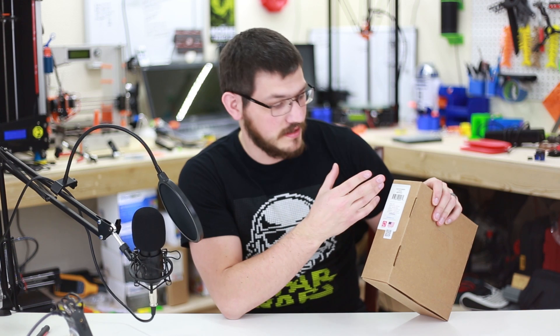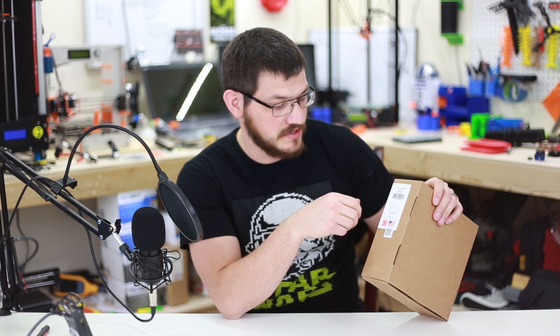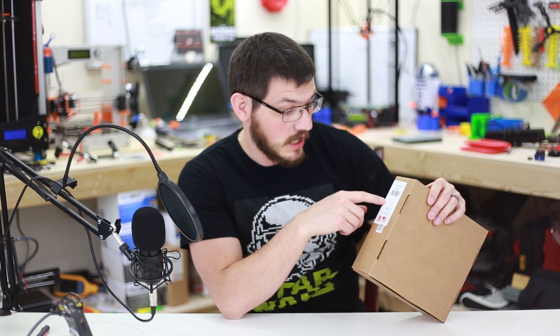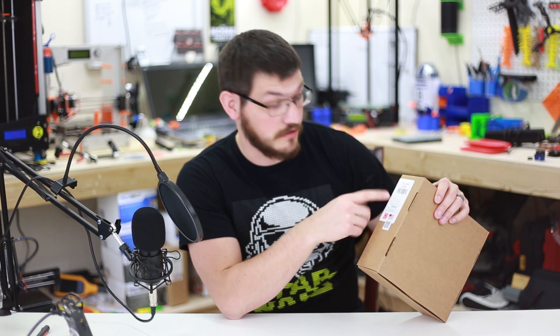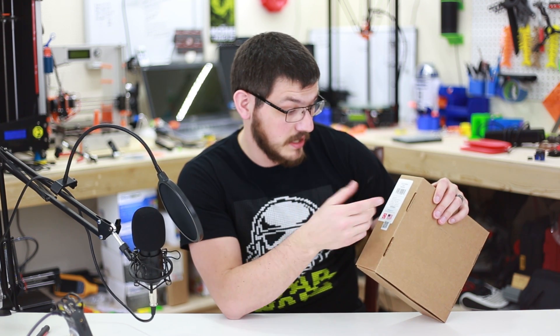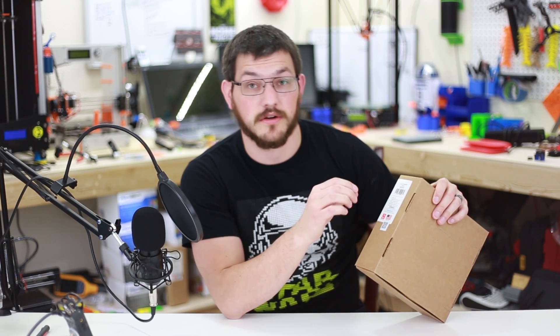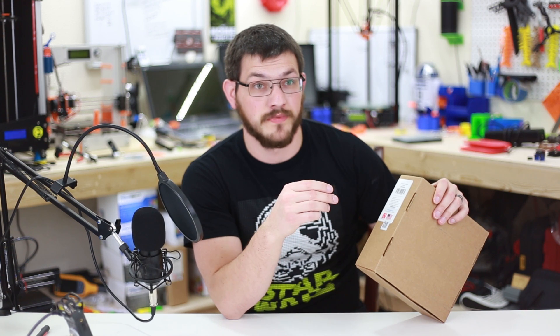On the side, they give a lot of super useful information. At the very top, they tell you what the filament is, the color, the size, their UPC barcode. Then it gives you a lot of information: optimal print temp 190–215°C, so obviously you know it's a PLA. And the length — I love how they do this — it is 1,063 feet or 324 meters on this spool.